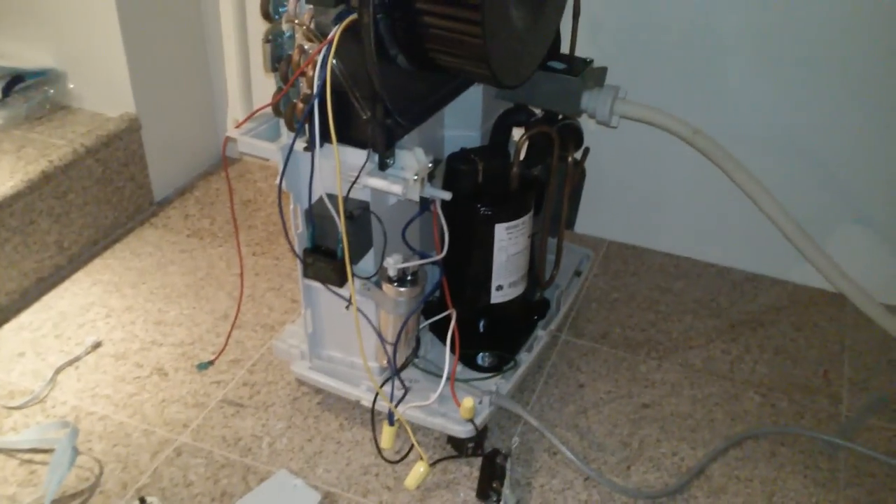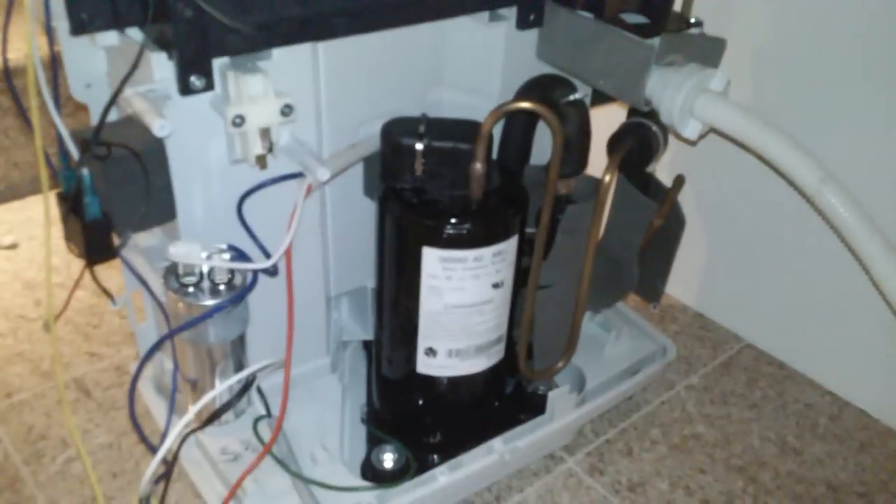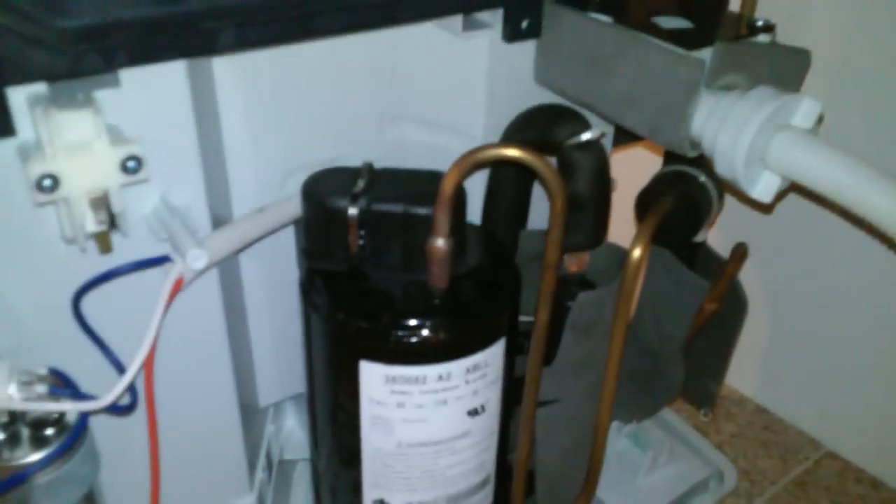This thing is cooking, this thing is cold, and this unit right here is hot — so it is working beautifully. There is no need to replace this dehumidifier. This was a $290 unit; it requires special recycling to get rid of the refrigerant in the system. Hopefully this will help you get rid of all the bullshit junk circuit board crap that was destined to fail. Hardwire your system into the line power and hook it up to a switch so you can kill the compressor and turn it on and off at will. That will allow you to de-ice the unit with the fan running, and also keep the compressor from a hard start — it allows the capacitor to charge up so that you can get a real good fire on your compressor when you activate the switch.